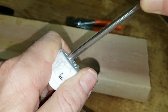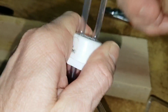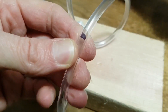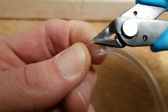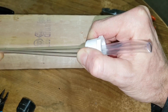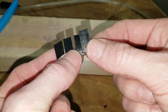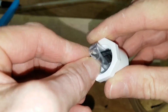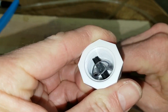The tubing needs to fit tightly in the holes to get a good seal. Remember that mark I made in the center of the tube? An opening is cut in the tubing at this point. It's open far enough so it doesn't restrict air into either half when it's folded and installed in the cap. These pieces of plastic were cut to space the opening in the tube away from the holes in the cap. They're stacked and inserted between the tubes, then I pull both whips until the opening is seated and centered on the divider.